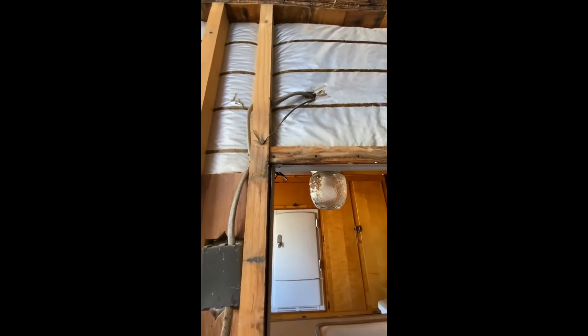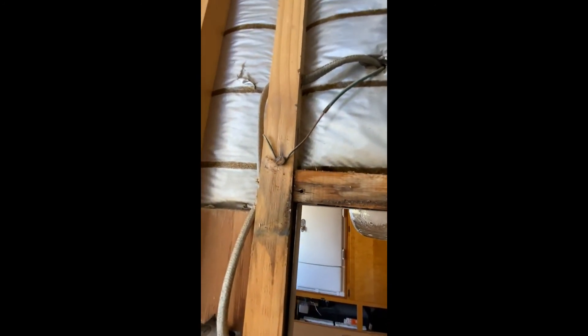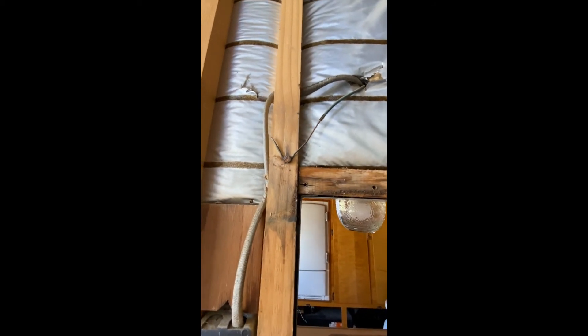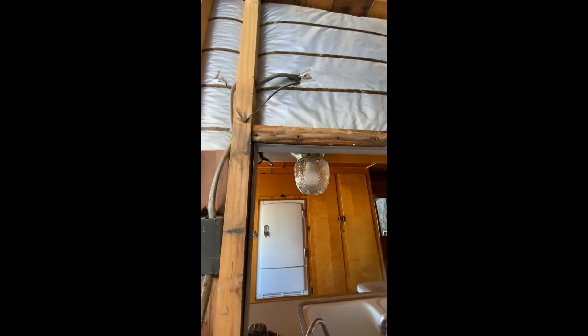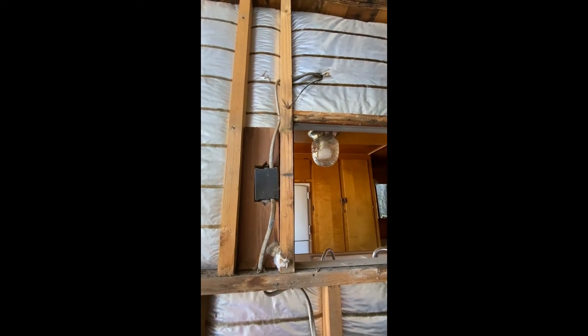Check this out — there's the electrical wire going in, but check out the ground. It's just screwed to one of the framework pieces with a nail or a screw, that's it. So all of them are like that where they go into the trailer — they're all screwed in by a nail for the ground wire.